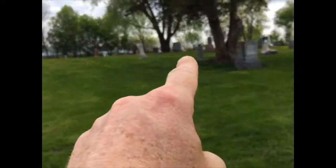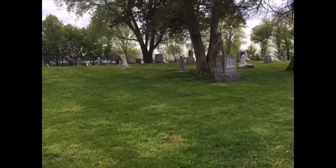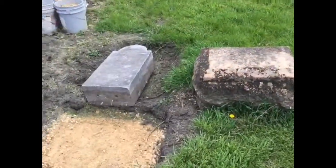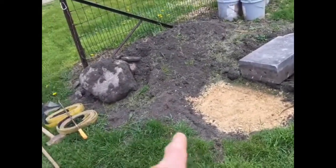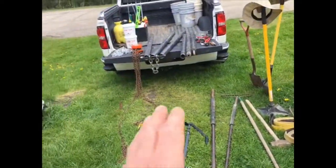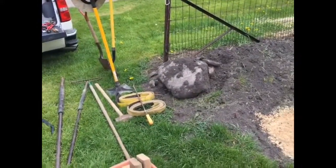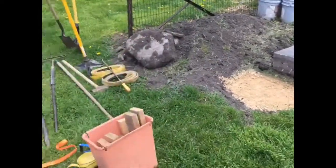The other thing I use the sledgehammer for is breaking up old pieces so I can haul them out. There's a big one up here — probably 300 pounds — but I've already removed two-thirds of it by busting it up with the sledgehammer. When you get into bigger items, that's where the tripod or pry bars come in — leverage, leverage, leverage. Use your head; avoid using your body as much as possible.